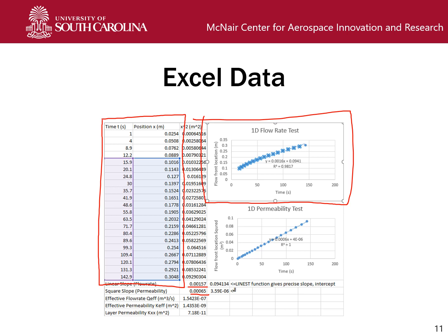I've already cut back the data to the point where it's linear. It's largely linear. If you want it to be really linear, we could cut off maybe these data points here as well, but it just gives a slightly different value for flow rate, and it's not different enough. We want to make sure we have a sufficient number of data points while ignoring the most nonlinear of them, which would be these here. And then here's our position squared chart. You need that as well.